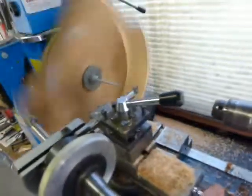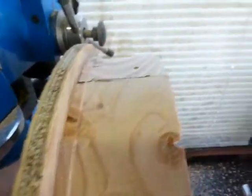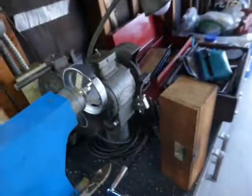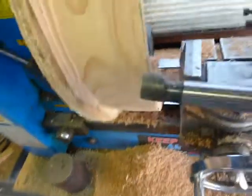Good. Nice and tapered, 3 degrees. I did start cutting through those screws, but I didn't mind. I got tons of boring bars, and I got that green wheel for that thing to regrind my tools. Yes, the draft is 3 degrees.